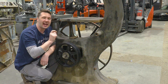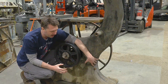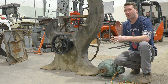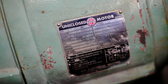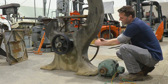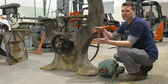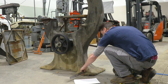Now I have a target to tackle the next project — getting a motor mount fitted to this machine. I'm going to try to keep the motor as tightly as possible to this frame, and I also have to think about how I'm going to build a guard system. This is a 10-horsepower three-phase motor that can take my finger off in a moment's notice if I'm not careful. It spins at 1,730 RPMs. I want to nest this motor into this little pocket right here in the frame — that way it keeps the footprint small, out of the way of tripping hazards, and also decreases the size of the guard I need to make.